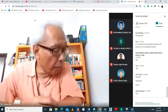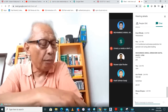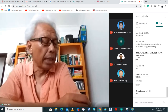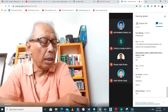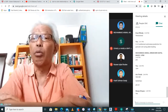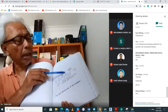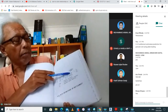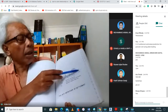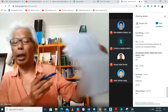So I can see that on figure 14.15, the definition of settlement, I have the original foundation level, and then I have one footing. It has the settlement, right? You have to imagine that from the original foundation level, the footing has gone down, has subsided by an amount called rho max. Can you see that? Yes, this is the amount rho max. It has gone down from the original foundation level. This is not the original surface level. This is the foundation level. It has gone down. Subsidence. All right? So that's the maximum settlement.